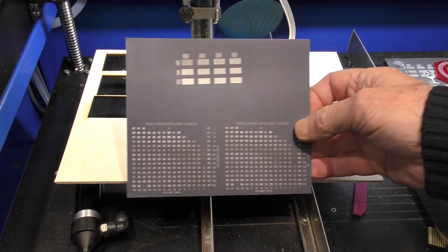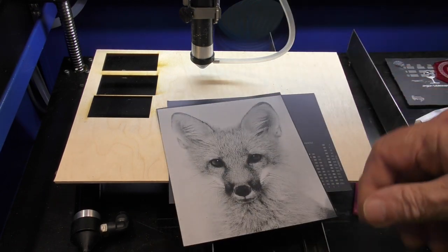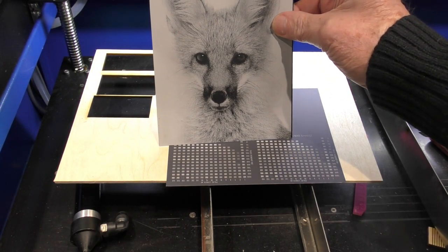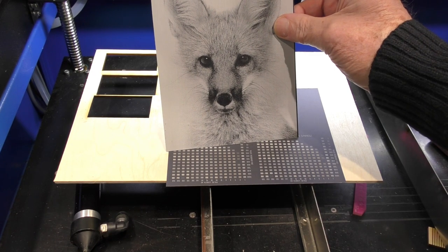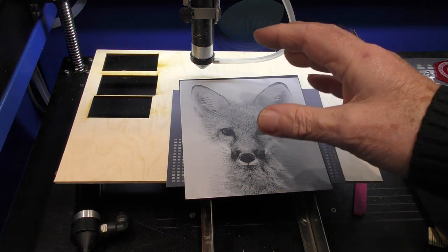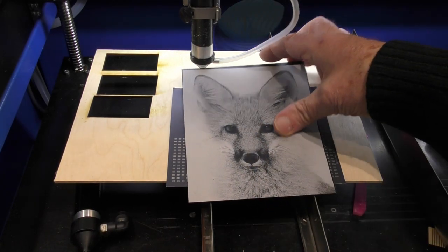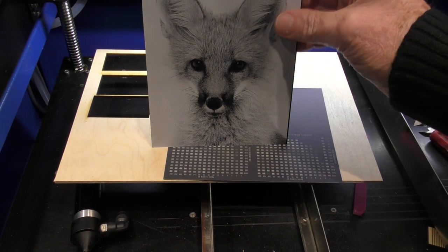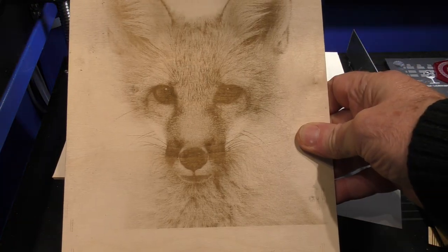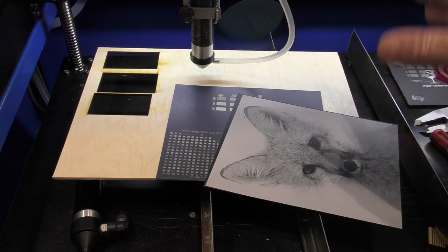What use is that? I mean, you'd certainly never be able to engrave a photograph on there, could you? I mean, anodized aluminium, photographs? Not possible. How's that happened? That was done on this machine. But it wasn't done with grayscale engraving. So the one thing that your machine will be good at is not grayscale engraving. But it will be able to deal with dithered engraving if you understand how to do dithered engraving. Dithered engraving is suitable for binary materials as well as wood. Please, please stop worrying about these things and learn how to do dithered photo engraving.